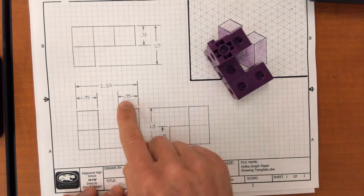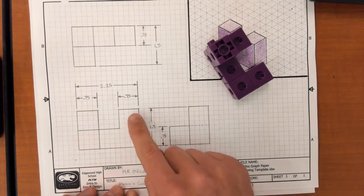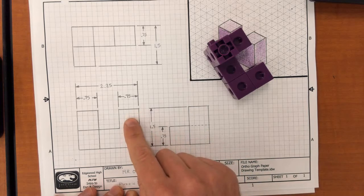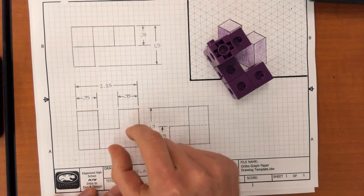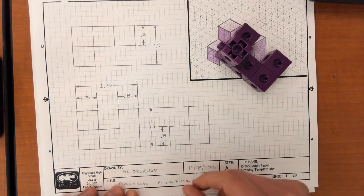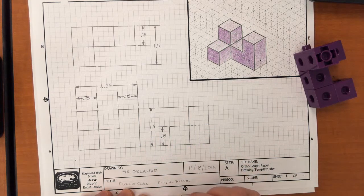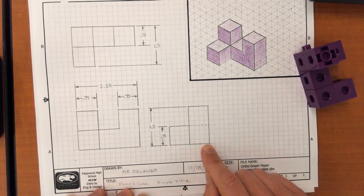It makes it big enough that it's easy to draw your dimension lines and have room to write your numbers in between, but not so big that you don't have room and you run out of room getting close to the margin. If you start going bigger than that, 5, 6, depending on the part, you might run into some trouble. And making these too small, well, I really don't have at this point that much room to even draw both the dimension line and the dimension itself. So if you start making this too small, it's just hard for you to even write and keep it neat and organized. And then we're going to see lots of extra white blank space and wonder why in the world did you not utilize that space. So again, this is a technical drawing going to somebody who's going to produce the part. We want it to be reader friendly, just clear, neat, legible. Also, this is now a stage where you should be pulling out a straight edge or ruler and being more precise with your lines instead of a sketch.